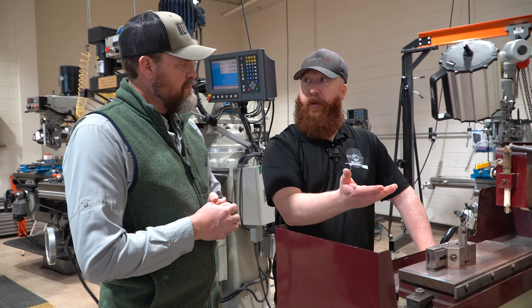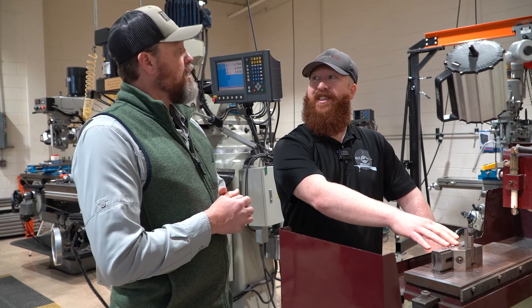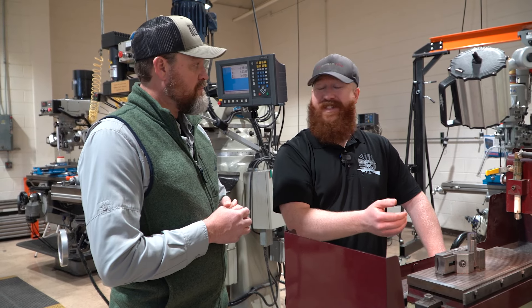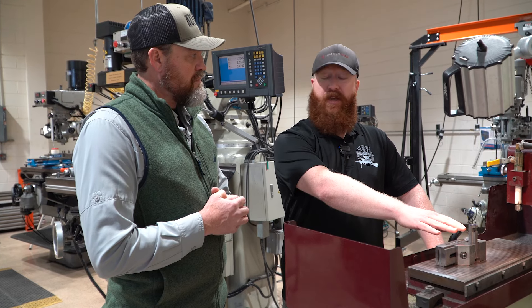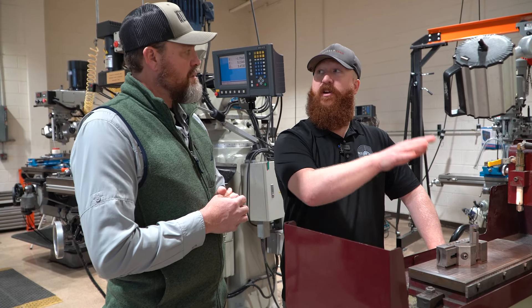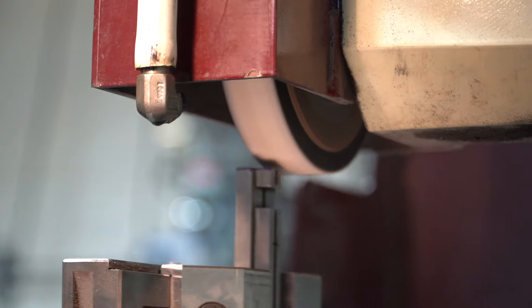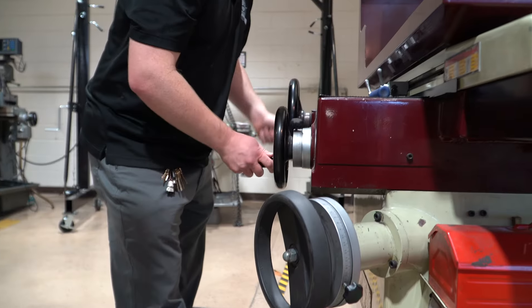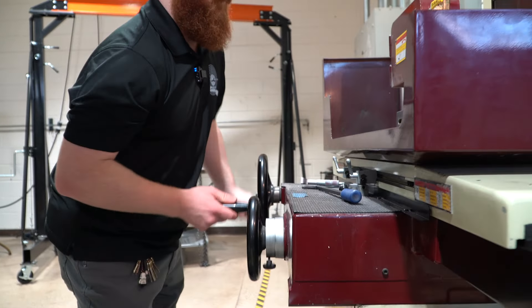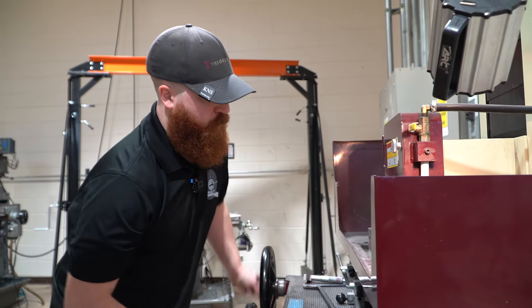What we're looking at is the height difference between the surface the rim sits on and the surface that stops on the bolt. We're looking for about 42.5 to 43 thousandths in height. A tall one is going to be about 46, and that's way too loose — yours is 48. It's significantly larger than it should be, and on these older guns there's going to be a high spot, so the bolt has been sitting crooked the whole time you've been shooting. Consistency is the key.